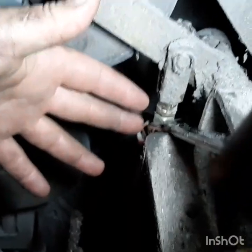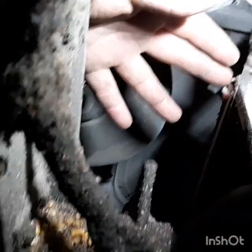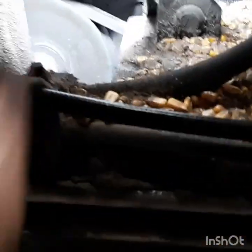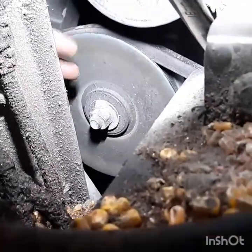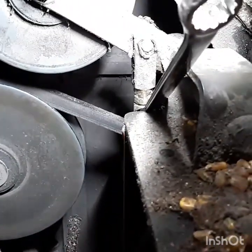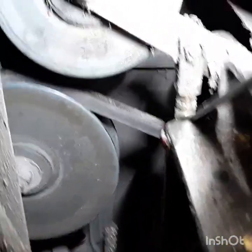Wouldn't be working on a combine if you didn't need a wrench with four angles in it and an arm with three angles in it and a shoulder out of the top of your head for your other arm. It looks pretty simple just to get to that nut, but the angle you have to get the wrench at — because on the front side you've got pulleys and stuff — it's slow going, but you just pick away. Luckily you only need 20 or 30 turns and that spring is back to tight, so belt's on. We just need to get some tension on that tightener.